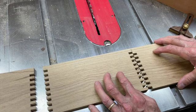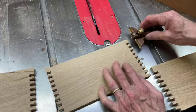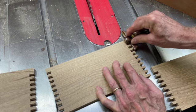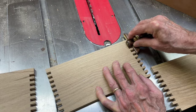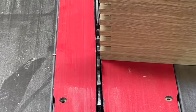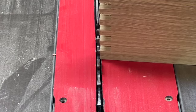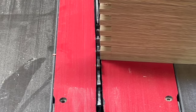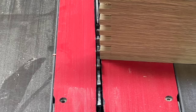To form it, I have to take a marking gauge and make a mark along there, so I have an index point to be able to do my setup. I put a blade in the table saw that has a square top cut — this one is made by Forrest, it's a Woodworker 2 with a number 1 grind. I set the blade height so it's just exactly at the height of the lower, narrower finger.